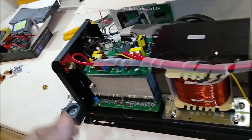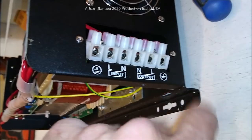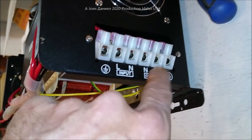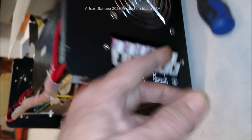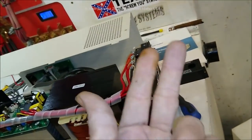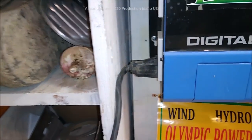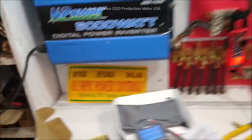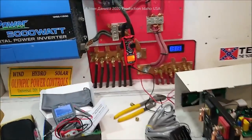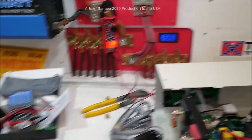Back to your battery bank from a power source. It has 27 amps — your ground, your line, your neutral — 27 amps. So you'll use just a 30 amp disconnect or a pair of 15 amp switches to run your power. We have to have this over here to run the lights in the shop, and that's a little 14 gauge — we're kind of stressing it a little bit, probably better with a 12, but that's the one we had available. And that is the setup going on.